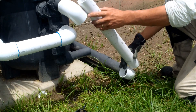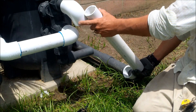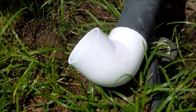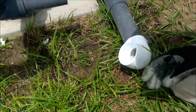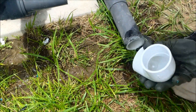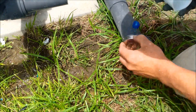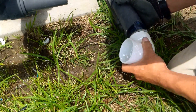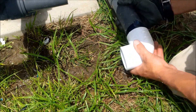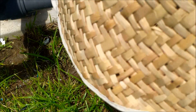This one's going to be a little trickier — I don't have the same slack. It's not attached to the pump so I can't really move it. But I lined up the elbows and it looks like it's going to line up good at this angle. This one's a little different: I cut the pipe to match. I'm going to glue the elbow down first on the bottom, then put the pipe in, and do the elbow on top last. You have limited time before the glue dries, so make sure everything is lined up when you do this. This glue dries really quick, then you want to give it a little bit of twist so there's no grass in there — that would be an issue. Adjust the angle and glue it to where you want it.